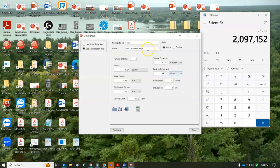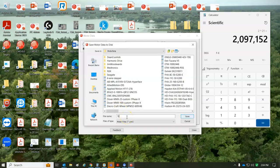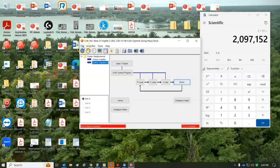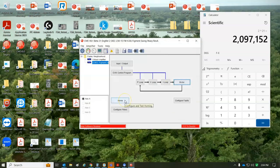So I guess, yeah, at the end of the day, did your tuning, save the flash, save a file. I'm going to save a motor file here so that if I get the next motor, I already have a file for the motor, the range of motors. And then for this drive, Xenus Compact 23015, you could save a CCX file. And what's it called? Trio XEC, bang. Good.